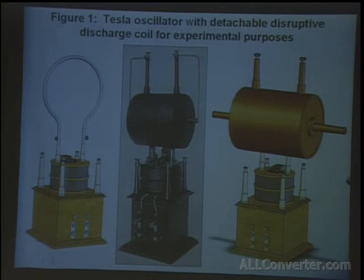The secondary is made in two parts, wound in a manner to reduce as much as possible distributed capacity and at the same time enable the coil to withstand a very high pressure, between which its terminals at the center are connected to binding posts on two rubber columns projecting from the primary. The operation is as follows. When the switch is thrown on, the current from the supply circuit rushes through the self-induction coil, magnetizing the iron core within and separating the contacts of the controller. The high tension induced current then charges the condenser, and upon closure of the contacts, the accumulated energy is released through the primary, giving rise to a long series of oscillations which excite the tuned secondary circuit.